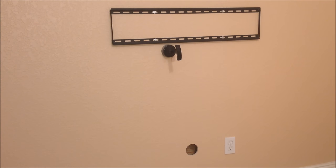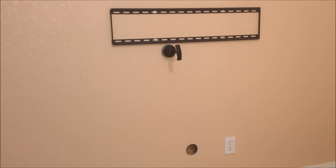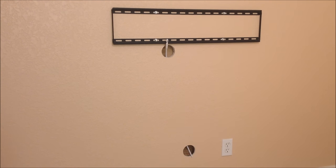The shortest distance between two points is a straight line. Some of the audio-video cables come in fixed lengths, such as optical Toslink cables, so I want to maximize by going the shortest distance possible. I chose a location for the upper wall plate that was slightly beneath the TV wall mount, because the actual wall plate has what we'd call an escutcheon or trim border around it. We did not want to hit the actual TV wall mount, and we don't want to hit the stud directly left of where we're cutting. We checked the instructions that came with the kit, and they recommend using the plastic fish tape — push it up inside the wall and first pull the electrical power wire.